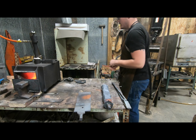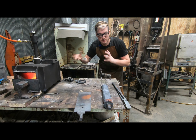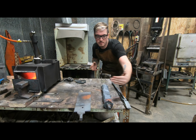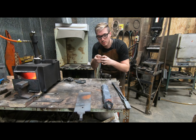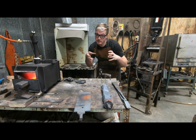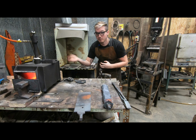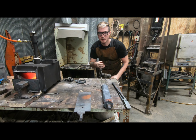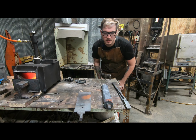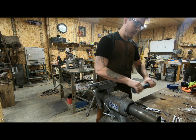So what I'm doing right now is I'm waiting for this to cool down so I can touch it with my bare hands and maneuver it and tool it and whatever else. And when it is cooled down just enough, I'm gonna cut it right where I put the two tubes together, the two canisters, and hopefully I got that middle welded so I can cut it and then use those two different billets that'll fit in my forge, because this one billet was a very big mistake.